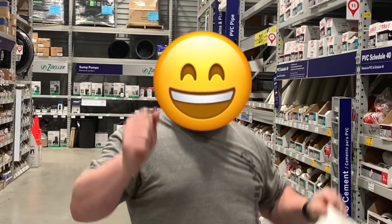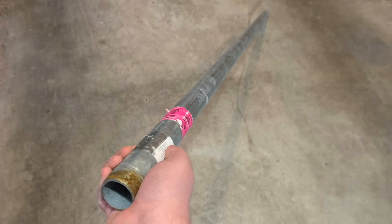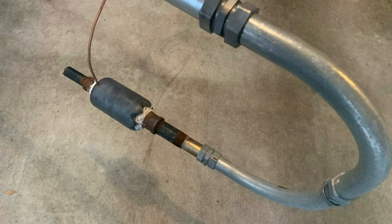It wasn't until the end of the month that we figured out how to achieve one of the goals — we actually achieved the second one first. One day, walking through our local hardware store, it hit us. All we needed was in the electrical aisle all along: conduit — the metal tubes that you put wires in. This type of metal tubing not only accomplished the second goal, but also solved a problem we didn't even think about. The exhaust tube from the first test was a 72 by 1¼ inch steel pipe — very thick and very heavy. The conduit came in pre-bent pieces and was significantly lighter than the previous tube.